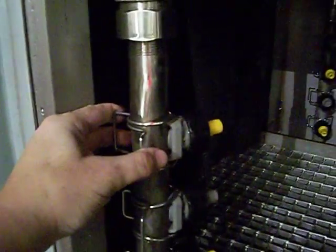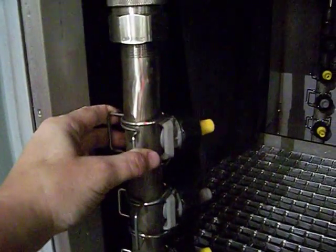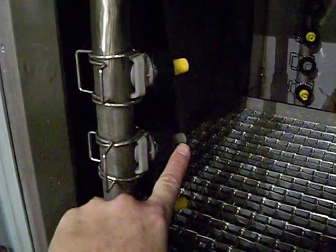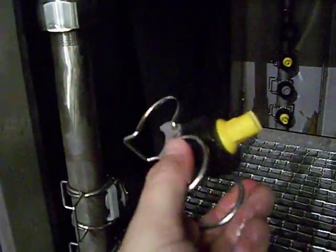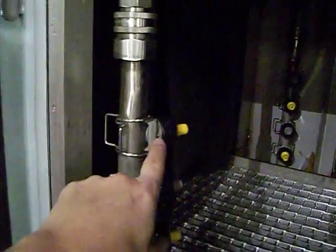You'll notice that the jets themselves — the items you see in yellow — are open tips and actually have water flowing through them. The gray-tipped jet nozzles are blocked; they are not in use at this moment. This system gives you the ability to adjust these by simply switching them out — they clip on and off relatively easily. They come off like so and go back on. Switching out nozzles is not a difficult task. Basically you've got your clip, your ring, and the nozzle itself making up the nozzle assembly.